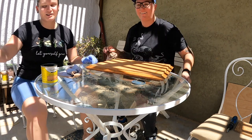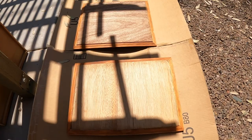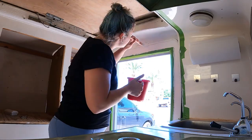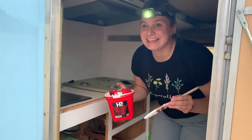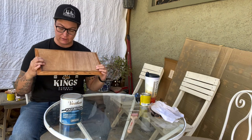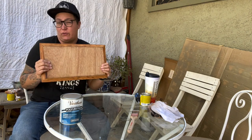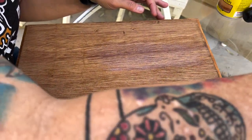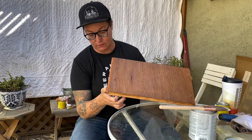There's one cabinet — same stain, same length of time, same everything — completely different. Coat number three. We're going to polyurethane these cabinets to help protect them and kind of lock everything in, especially because we've sanded them down and then stained them, so they're really kind of open and a little bit vulnerable. We went with a semi-gloss. It has like a bit of a shine — it goes on kind of milky and then it dries clear.